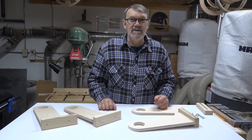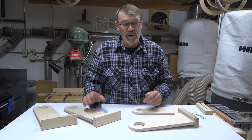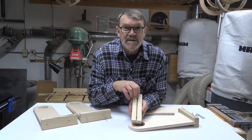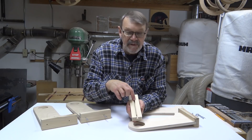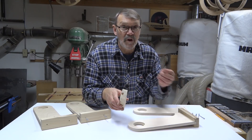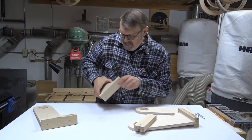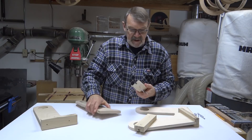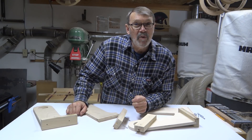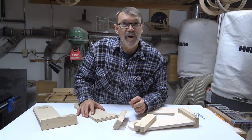I'm just about ready to put these on the wall. The last step I didn't bother recording — I'm going to assume if you're a woodworker, you know how to drill a hole. You can see I've got the screws through here. I used a nineteen sixty-fourths inch bit — the biggest that would fit inside this slot — and countersunk two holes just deep enough for the screw heads to sit in. Then I used an eleven sixty-fourths bit to go all the way through. Because it's countersunk, these are tight, but this will still slide into the dovetail slot. Now I'm about ready to put them on the wall; I'm not going to climb up on the ladder and narrate, so I'll just show you after they're finished.